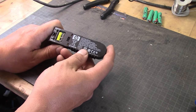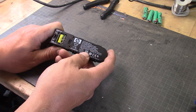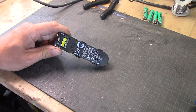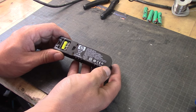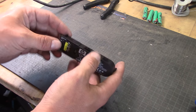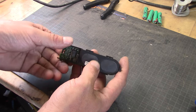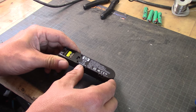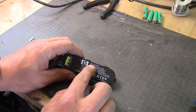What's important when you do this change is that you know what type of battery you are going to swap out. This unit here consists of two parts — I'm not sure if this is the same on all units — but for the HP G6 you have this PCB here where you have the charging circuitry and everything, and this is what the server itself talks to. On the other end, inside here, you have the battery. In this battery we have 4.8 volt nickel metal hydride.